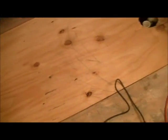So this will be about a 3x5 shower with the 3-foot knee wall, 2-foot opening. The tile will go all the way up to the ceiling. Back here there's going to be a niche. In this case I'm not going to do the normal niches I do, which is usually in the middle here because of the stack. So the customer wants, between the studs, which should be 16 inches, he wants 24 going up, and then he wants it halved. So in other words, you're going to have a 12 by whatever this ends up being. It's supposed to be 12 also. 12 by 12 bottom with a centerpiece here for another shelf, and then 12 by 12 on the top. So it's going to be 24 from here down to here with a shelf in the middle, a 2-shelf niche over on this side. So that's where that will be.